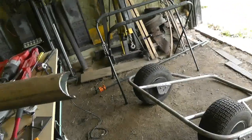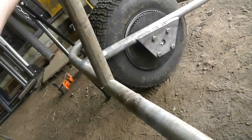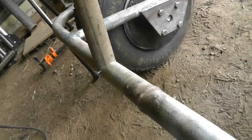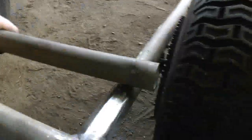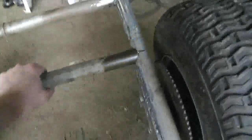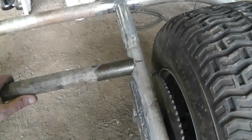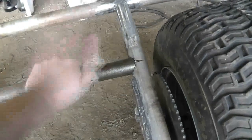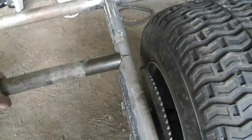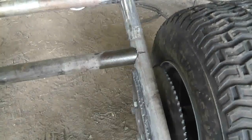Yeah, it was a little bit off center, so I'll have to re-center that. Looks like it was sitting a little too far back. But planting that against there, it looks perfectly good — a very tight fit, and should be perfectly square. So I just have to figure out where I'm cutting this end and we should be good to go. We're all in there — fitting up really really nice. That's the only way I'm going to do these fish mouths from now on; that was so easy. Fits in there great — maybe a little bit too tight, might be spreading it apart a little, but we'll brace it up good.